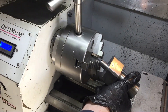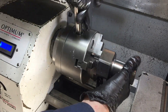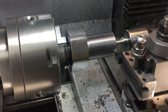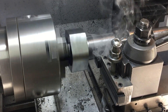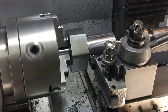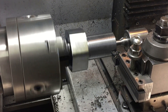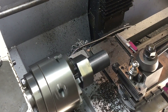Time for the bolt. At least I can see what I'm doing with this given that it's an outside thread. I'm taking much lighter cuts than recommended but I'm still getting chatter — it is cutting though, so I'll persevere. I've got to admit that this isn't particularly satisfying and not fun because I'm taking such light cuts, but I eventually get to the recommended depth.